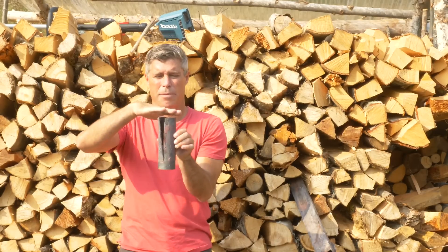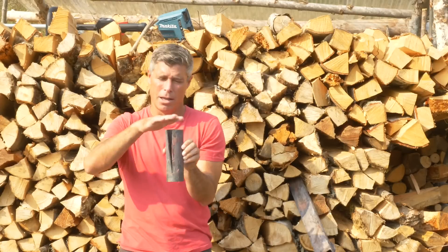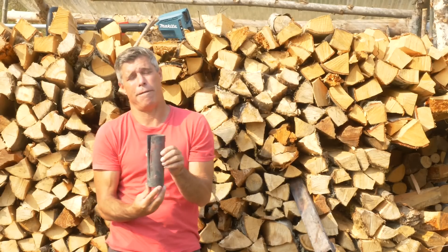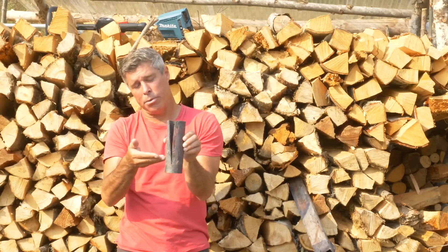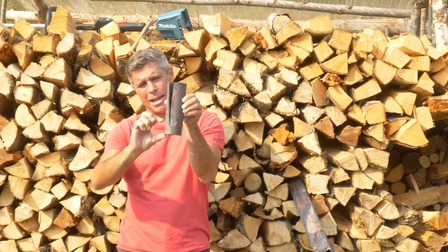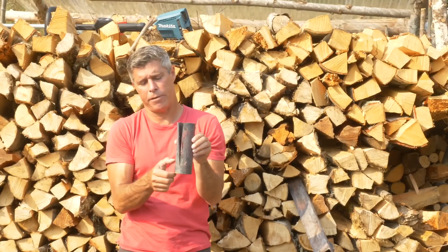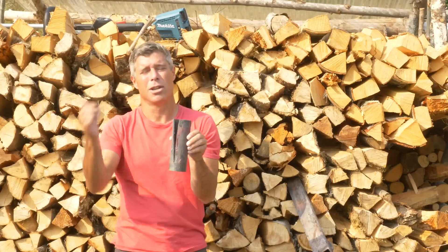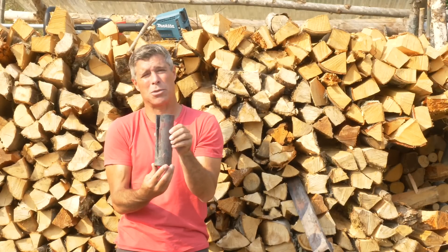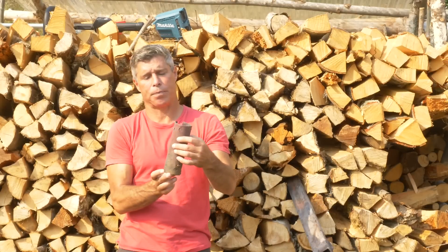While you can get small advantages with the slit or the vane, they're going to disappear within a few months of burning. My viewpoint now is I don't agonize over the final shape — a plain piece of tube with an open top works fine from a performance standpoint, and you get a much longer life. I go through about one of these in half a season, so I typically put two new ones in every season. They get down to a nub, and that's when ash and wood start plugging things up — that's when you know it's time to replace it.